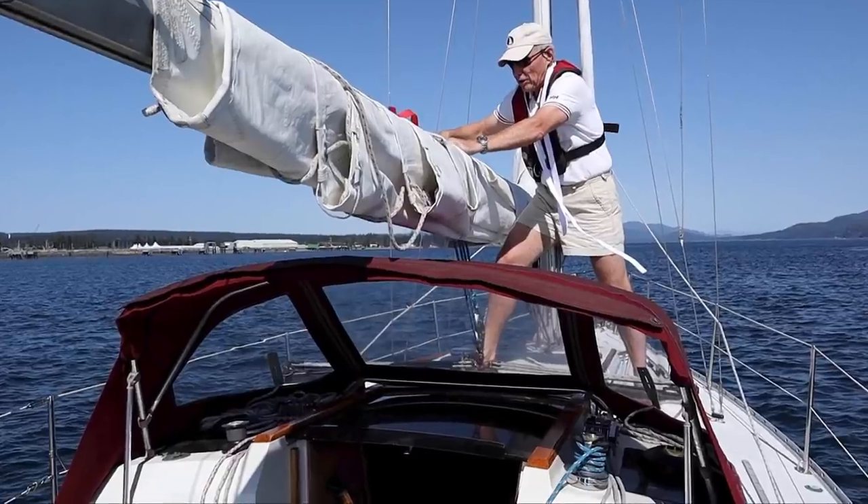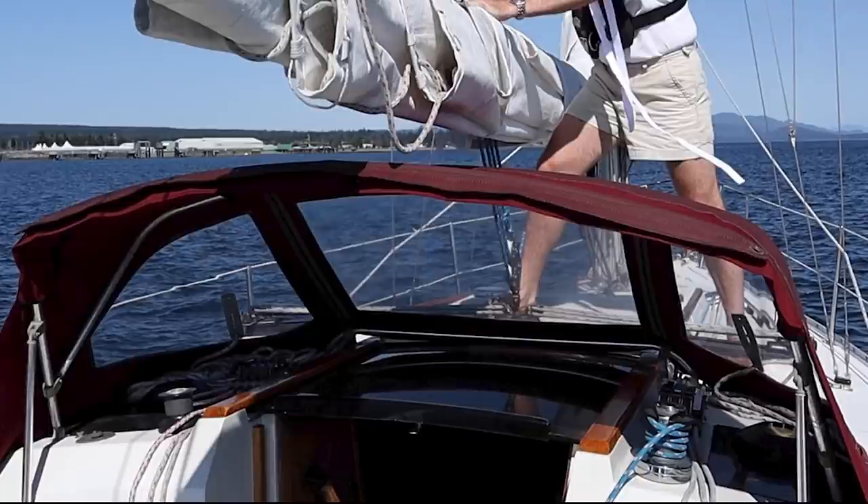Lines led aft — this is a really interesting one. On this boat I have all my lines led aft: my halyards, reefing lines, and boom vang are all led into the cockpit. My topping lift is still up forward, so I plan to lead it aft as well. Something I've seen on modified boats is reefing hooks at the gooseneck but halyards led aft — you can't really be in two places at once, easing the halyard and hooking on that reefing hook. Either have them all at the mast or all in the cockpit. The cockpit is safer, though many traditional boats have everything at the mast. Keep them all in one place so you can get to them.